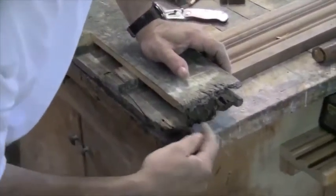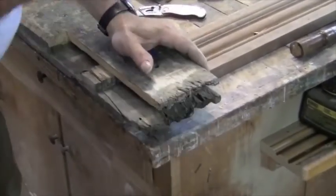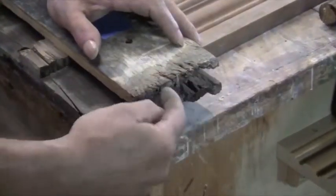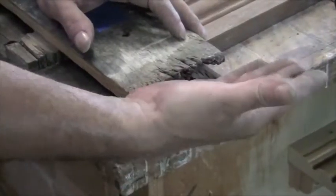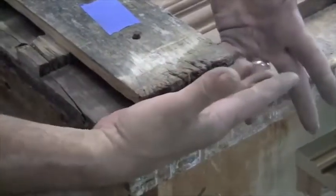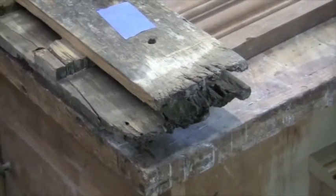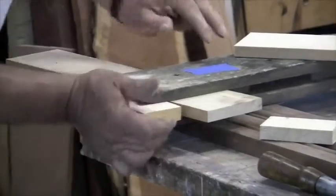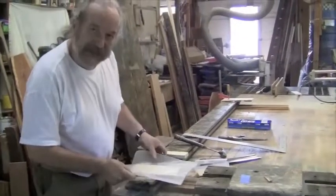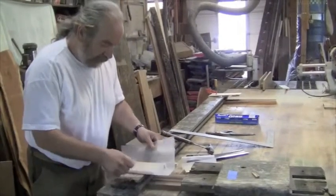That will leave me with this end still rotted, you see rotted back, and after this is all done and I take it apart and trim the thing down, I'll repair this by just filling it and basically puttying it out with epoxy, so that the remaining pieces, which are strong enough on the inside but visually still a mess, will fill out, and I'll be able to trim it and make it look like something. Epoxy doesn't stick to the wax, and so it makes for a great barrier material for this kind of thing.